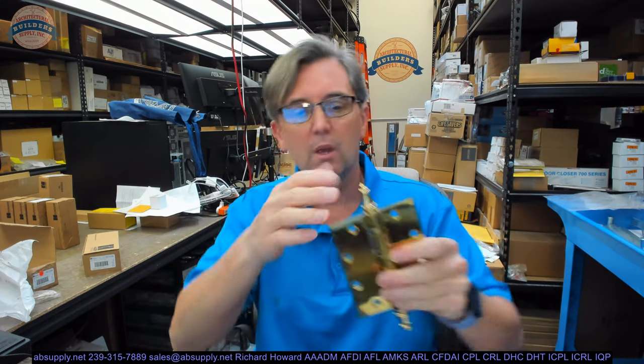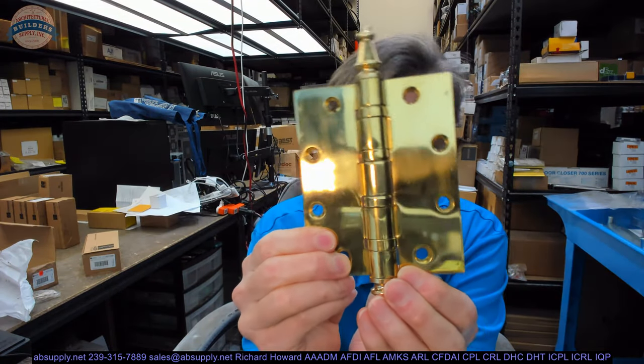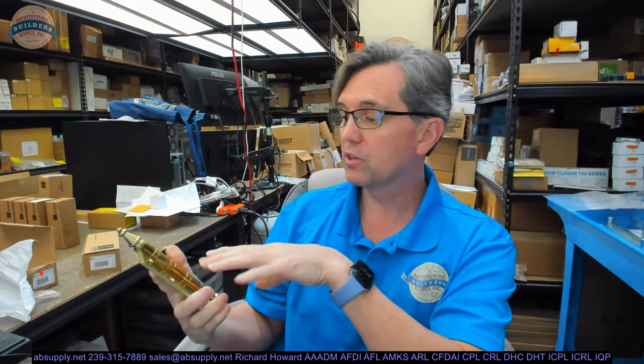Steeple is not uncommon — it's not something you'll never see. Ball tip is very common, it's about the size of a small marble. Now, 605 in the part number means three things: solid brass, highly polished, lacquer applied. That lacquer is to protect that brass finish. You can look at it and definitely know that it is actual solid brass. Actual solid brass versus plated steel has a warmth to it — you can immediately tell it's not plated. Plated is far more metallic, shiny, reflective. Polished brass is warm and inviting.